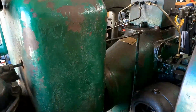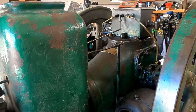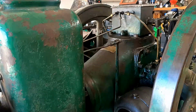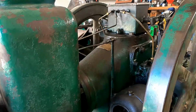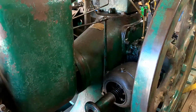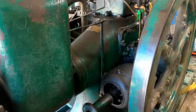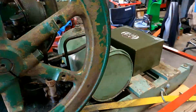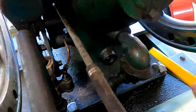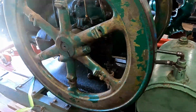So one thing about these Moguls is there's a ring oiler on the crank, and the clutch side oil system for that main will drain into that ring oiler. It'll sling it around, and that's how the rod gets oil. These crankcases are closed, but there is no oil in them. The oil that gets in there actually drains out, down here in this drain baffle, and just runs out. So even though it is closed, it's not like an engine today with a closed system.